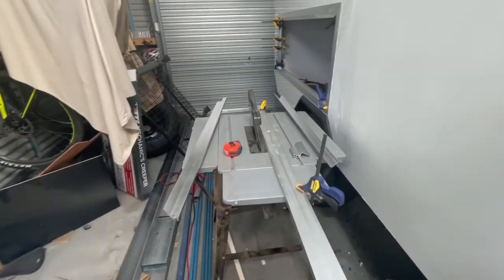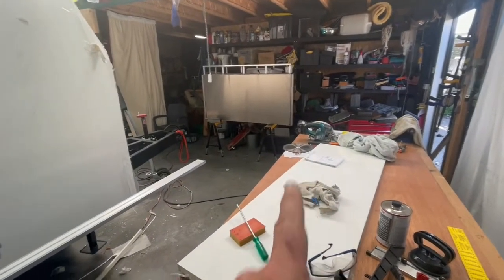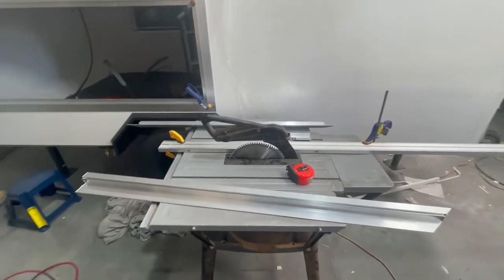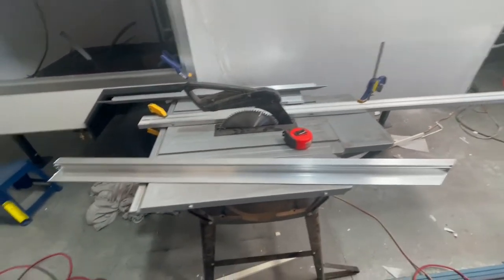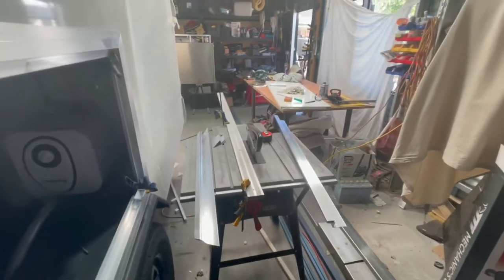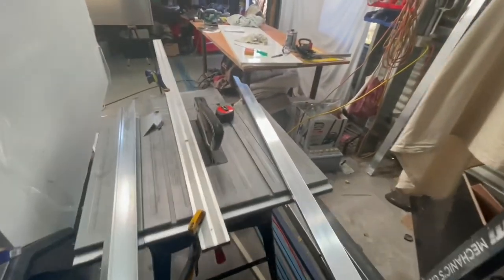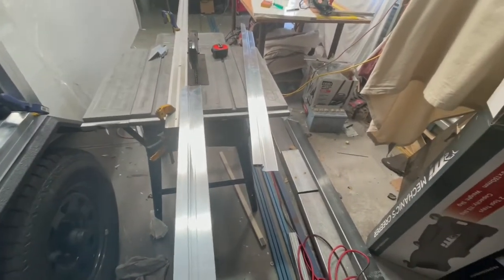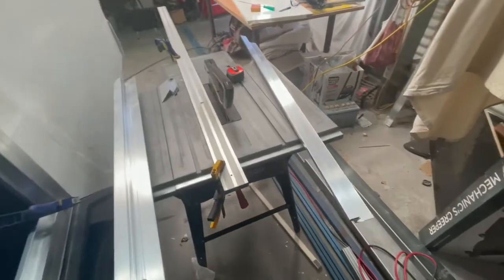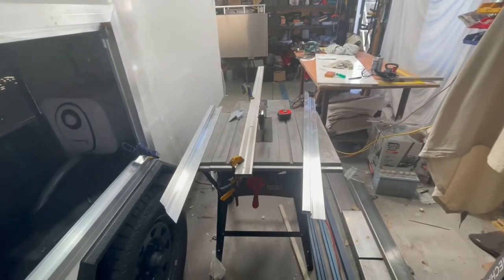I've decided to give it a go. I found the old drop saw that had an aluminium blade on it already, so I just ripped this one out of the table saw and chucked it in - same size luckily, so I've got a 254mm aluminium blade in there. This thing scares me a lot - it's really loud and bitey. It sounds like a jet engine taking off and can do some serious damage. So I treat it with a lot of respect. I've clamped a straight edge because it's the right height for these to slide through, and if I keep them tight against the straight edge it should be straight. That's the plan anyway. If this is a success I'll probably be kicking myself for not doing it for every single hatch.